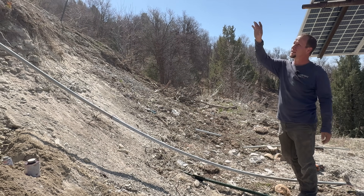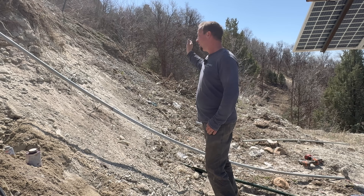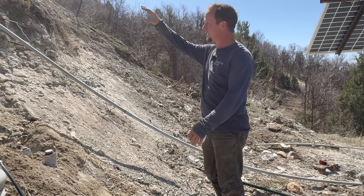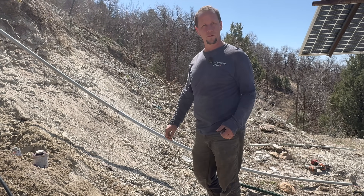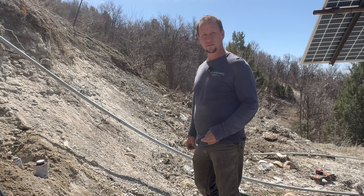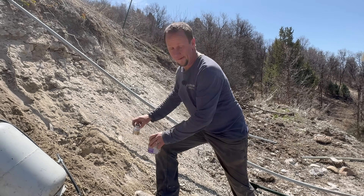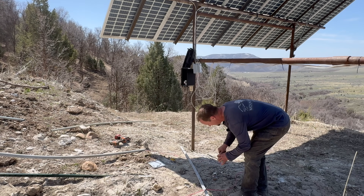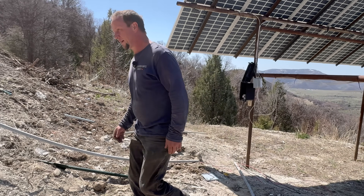I want to kind of bury this out to at least here because I want that upper parking in front of the shop to come out at least another six or eight feet. We're going to continue it around and just push things off here to build that road up there. If I can just get this to lay down nicely, it won't be raised, and when we bury it over it, it compresses and cracks or breaks. So we'll just get it to lay down good and then we can be in good shape. It'll be nice to finally get all this wire connected and in conduit protected.